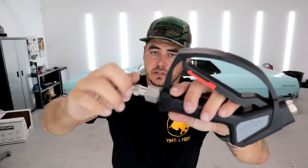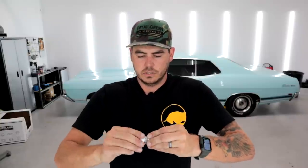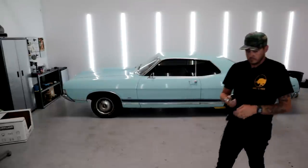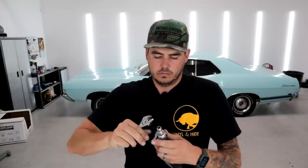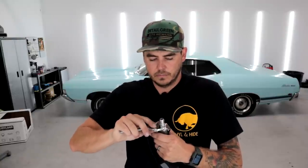Here's my quick connection — I'll just have to spin that in. I am going to wrap it with some Teflon tape just to seal it up, to make sure we're not getting any leaks down the road. We'll tighten that down into the swivel piece — we're going to need two wrenches for that. You need one wrench on this side to hold it in place because it's a swivel and it's going to want to move on you. Then take the other wrench and tighten it down. Nice and snug.